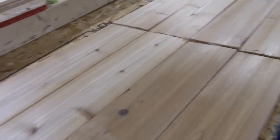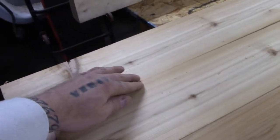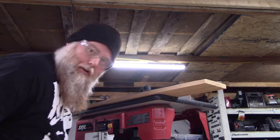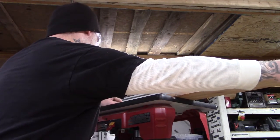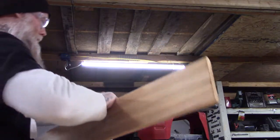The reason I haven't laid them out flat is because I want the bottom to be flat and the top to be flat, but I want the middle edges to round in on each other — it'll just give it a nice little flow to it. So let's go ahead and get those routed. Can't find my glasses — safety first. Alright, now we're ready. That's a nice rounded edge there.